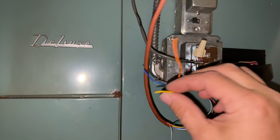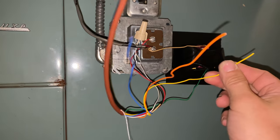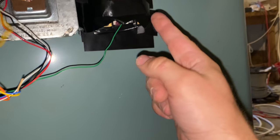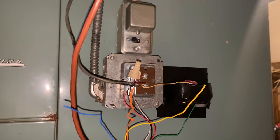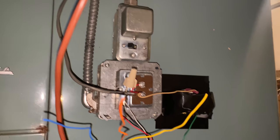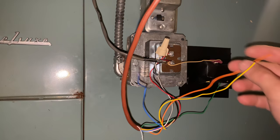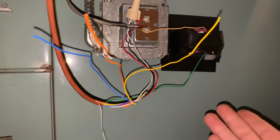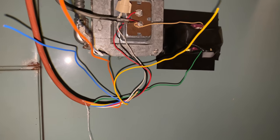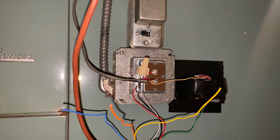That was the other option — I could have also wired up the yellow AC wire. There is a second connection on there I could plug into to turn the blower on that way. When the thermostat calls for air conditioning — which this furnace doesn't have — we have a window unit that will circulate the air through the entire house rather than actually turn an AC on. It just circulates the blower. That should work because when it calls for air conditioning, it should also turn on the blower.